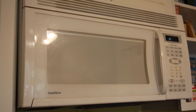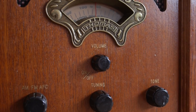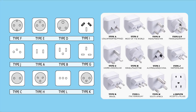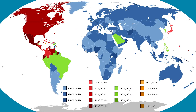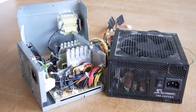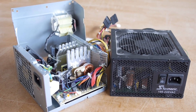I've talked about how transformers can be used for circuit isolation, converting mains power, and inductive charging. Transformers are also used to further step down voltages for household appliances. Impedance matching is used extensively in RF and audio circuits. Transformers can be used to convert voltages for devices designed for various countries, like 110 volts in the US or 230 volts in the UK. They are also commonly found in switch-mode power supplies with a DC input to a DC output.